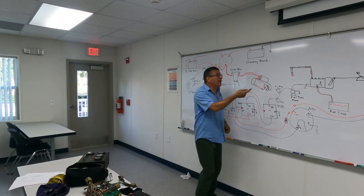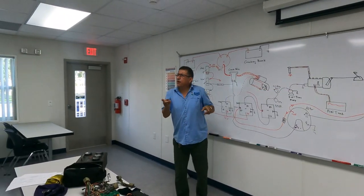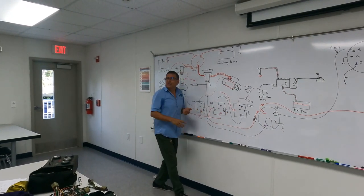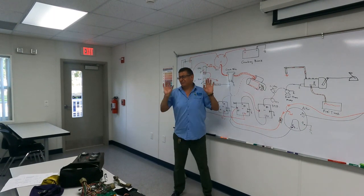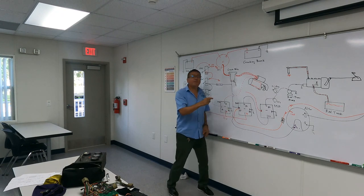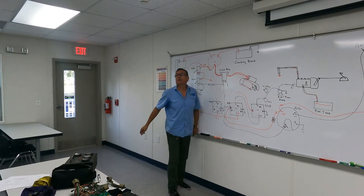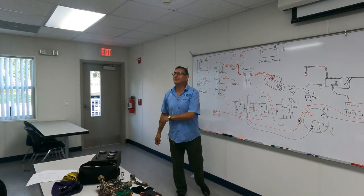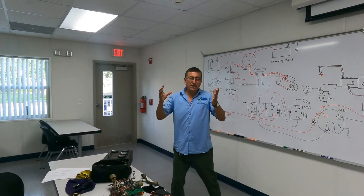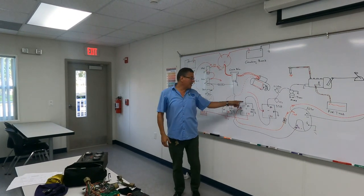Or, what is the cable? Excuse me, I don't have the fuel transfer pump and I don't have the solenoid. What is the problem? Those switches are the relay. Let me check if during the process I have power coming out through 87. No, I don't have it. Okay. My problem is here on the relay. You need to troubleshoot the relay or replace the relay. Let me replace the relay with another one. Boom, start. Okay, the relay.